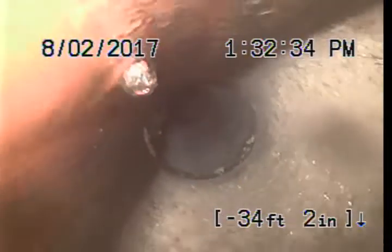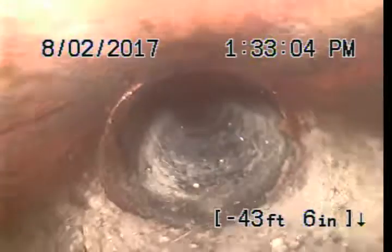Anytime we have water pooling in the line, and we flush the toilet, solids, solid waste, toilet paper, the only two solids that should be going down the line, period, those things start getting caught at that pool of water. They start flowing down the line, they hit the pool of water, and bam, they stop. And if you times that by maybe 1,000, just over time, those things start getting caught, they start creating a dam, and what we call a sludge blockage, where the only way to remove that is by hydrojetting, which is not cheap.